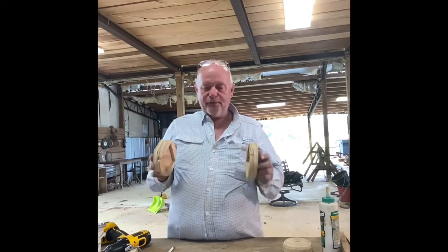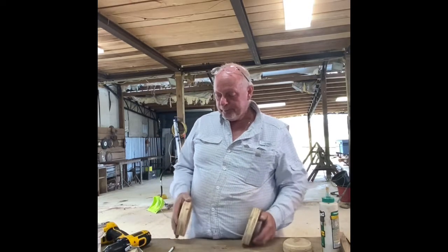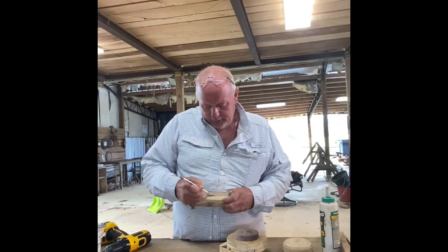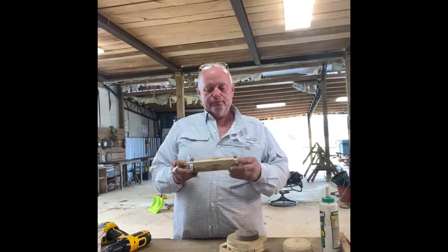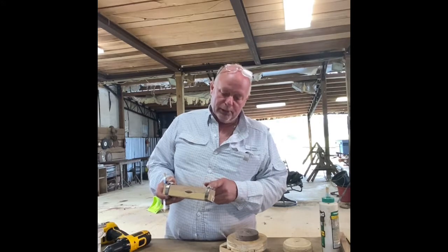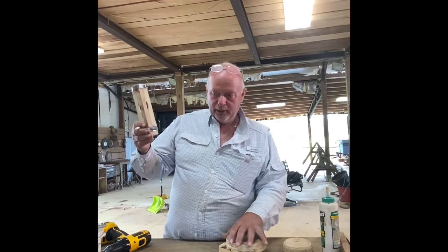Go watch some other YouTube turners — their designs are fabulous, probably better than mine. I'll show you some finished pieces in a few minutes. The only thing to watch when turning is if you get too deep. We've got a teardrop design — you follow that. I usually fly by the seat of my pants, but marking it is probably a good idea. You can turn the lathe off, look at it, make finials on the bottom. For ornaments, I turn the top kind of blunt, then hot glue a piece of wire down through to make a hanging hook.